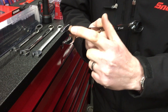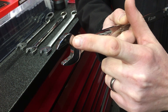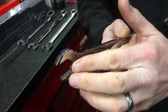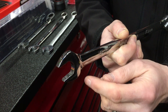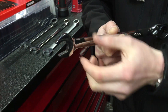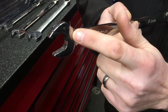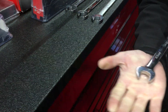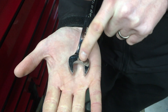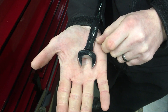If you look at this angle here, this is Snap-on's continuous arc design. Some manufacturers put lots of flats in here and tell you it's biting on four different places — that is incorrect. When you put it under load it's only ever going to bite on two faces, and the wrench is going to try to spread apart. The way we reduce that is with a continuous arc design. If you were to lay this wrench on a piece of paper and draw around that arc, you would see it makes a perfect circle, spreading the load perfectly across the jaws down the shank.